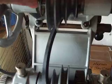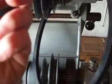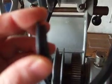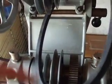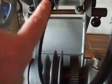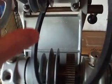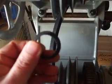However, after they're fitted, the headstock pulley guard, which then fits over them, is just too tight. They interfere with the fit so much that it's detrimental to the use of the actual lathe. If you wanted to open the guard to change the pulley over, for instance, it's a struggle to get the guard open with these rubber bushes installed.